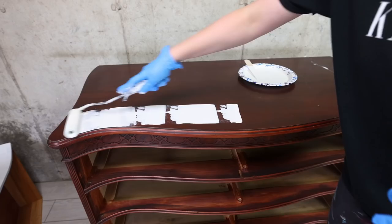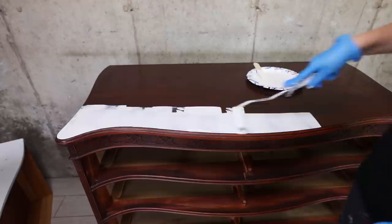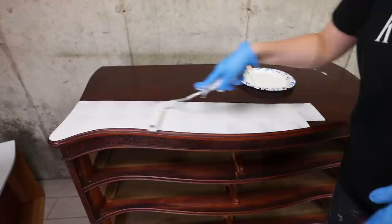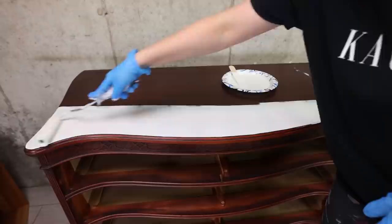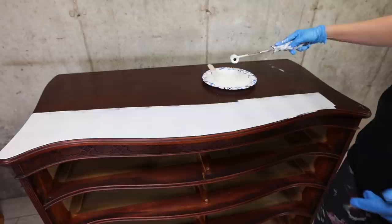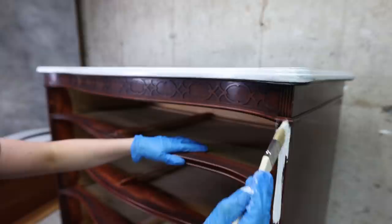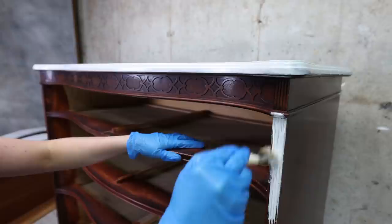The reason I love to apply this primer with a roller is because it gives you a nice smooth finish. Every time I try to use a brush it comes out messy with brush strokes. So I prefer the roller — it's much faster. It's also very hard to clean, so I just toss the rollers away when done. For the little parts you have to use a brush, and for that I prefer a cheap brush so I can toss it away too.